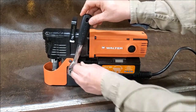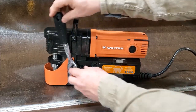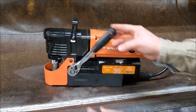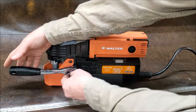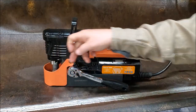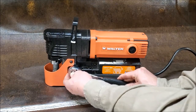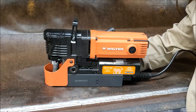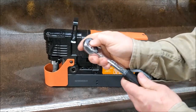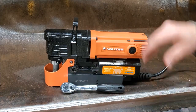They offer just a simple ratchet — pretty genius. If you want to crank down, you start here and off you go. What I've found from using this is that from point A to point B, a half turn — 180 degrees — gives you approximately one inch of movement on the cutting head. The other cool thing is it's reversible. You can switch the handle to the back side; it's the exact same setup. Push it and flip it to the other side.